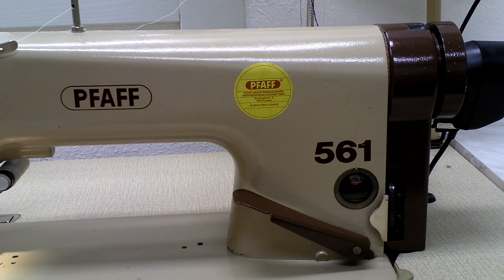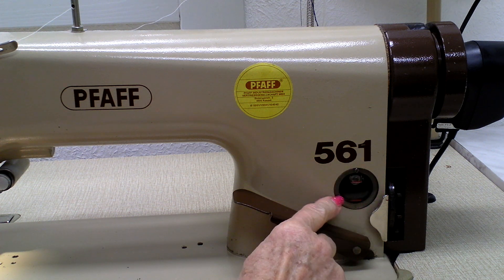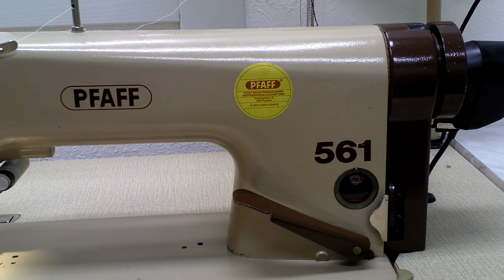You will see it is not difficult at all to take care of an industrial sewing machine. First of all, you can see here on the right side that you have this viewing window, because that is the main input for any kind of oil this machine will need for all parts to work correctly. And you see two red marks on there, which give you the minimum that should always be filled with oil and of course the maximum.